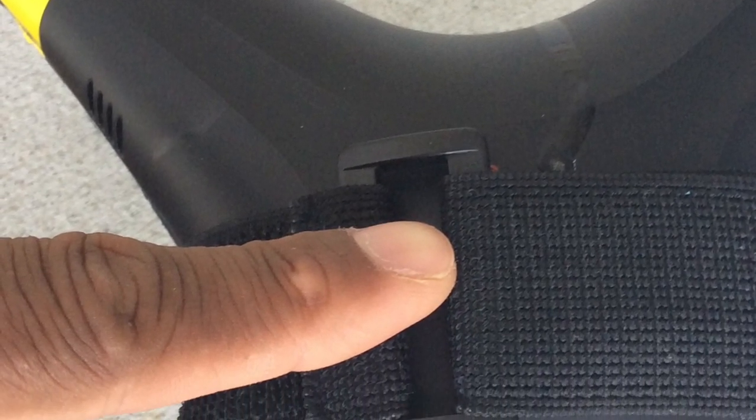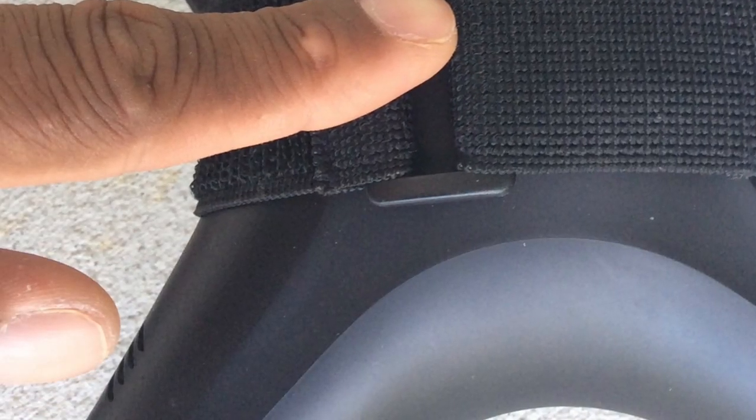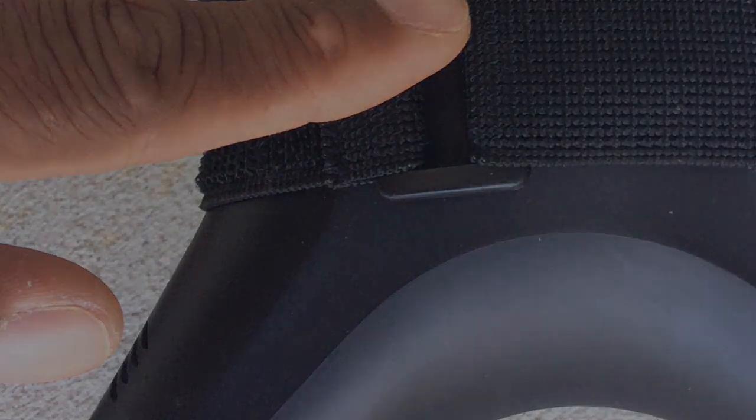We're at the final step: thoroughly analyze the quad. Analyze the landing feet and make sure there are no gaps where they screw on — this is another big contributor to jello. I use a sponge to dampen any excess vibration or jello effect and also to position the camera facing down a little more. I purchased this strap for $3 or some change on eBay — it's a good strap to mount your camera to the credit card mount. Thank you and God bless.